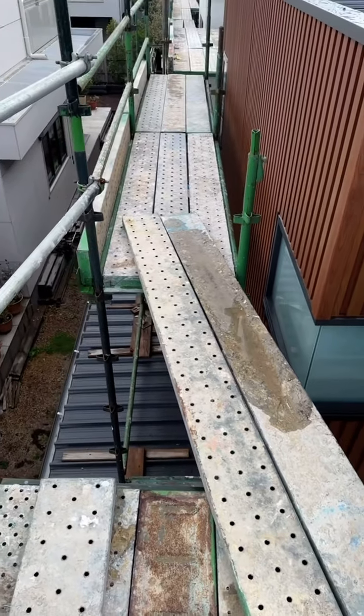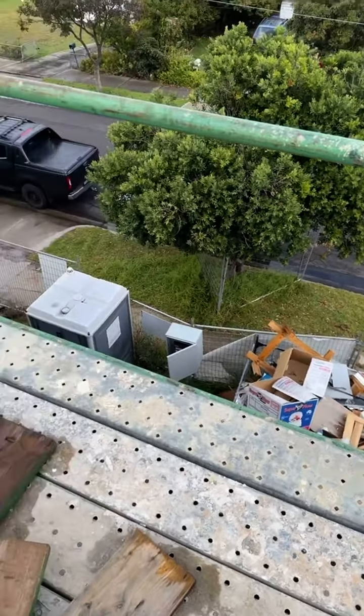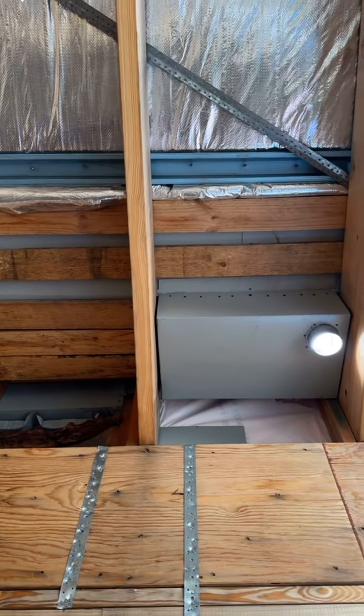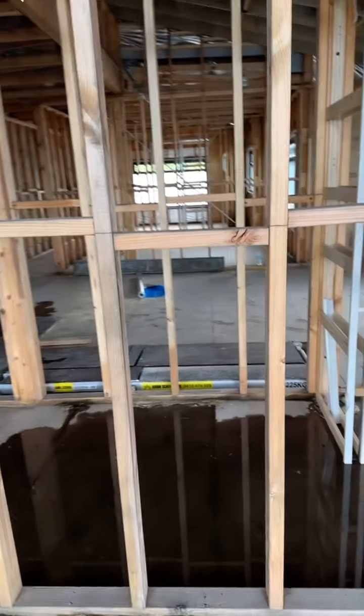They told me get a scaffold. They said it will be safe. It will be very safe. So here's a sump with no support, and here's another one. No support, non-compliant. So all the water is discharging straight into a mini swimming pool. Wow. And here's another one as well, non-compliant. Check out the water, and this is a lockup stage.